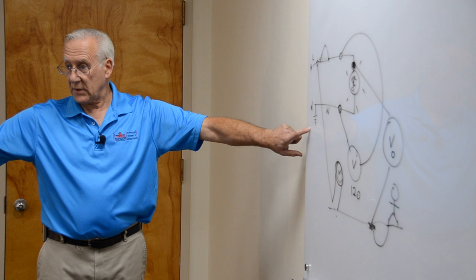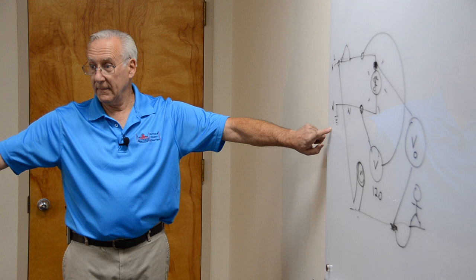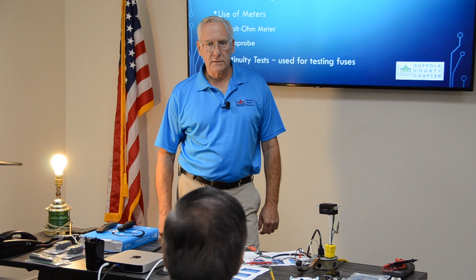They're usually in the box, aren't they? Usually yeah. Connected together. They're connected to earth. But I just showed you a white wire that was hot, didn't I? It did. Yep. It happens all the time. That's called backfeed. So when you want to touch that white wire, at your skill level, isn't that more of a zap too? Sometimes. The zap is going to be how much power that bulb is going to deliver. That's going to be the zap. It's the weak link in the system. Okay?